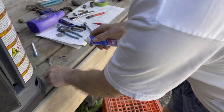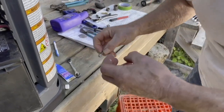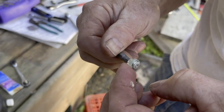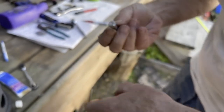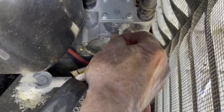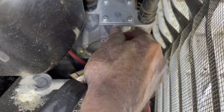Let's see what we get. It's the same static pressure as the first test — pressure rises to 10 inches water column. So the pressure between the supply on the black iron pipe and the regulator in the generator is the same at both ends. The problem has to be somewhere else. Let's put the 1/8-inch plug back into the regulator.